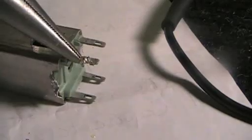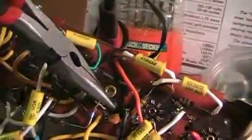I put the coil back into the can and I'm going to bend those little metal tabs back over to hold it down in there. This is the second IF can, and if you notice, I've got the coil in there upside down — the one lug that had the wire attached to it is supposed to be on the bottom side. So I'm going to take it back apart and put it back in the right way. Now I'm going to press the metal tabs down and check for any shorts between each lug and the metal shielding itself. Once I'm absolutely positive that there's no short, I'm going to insert it back into the radio.